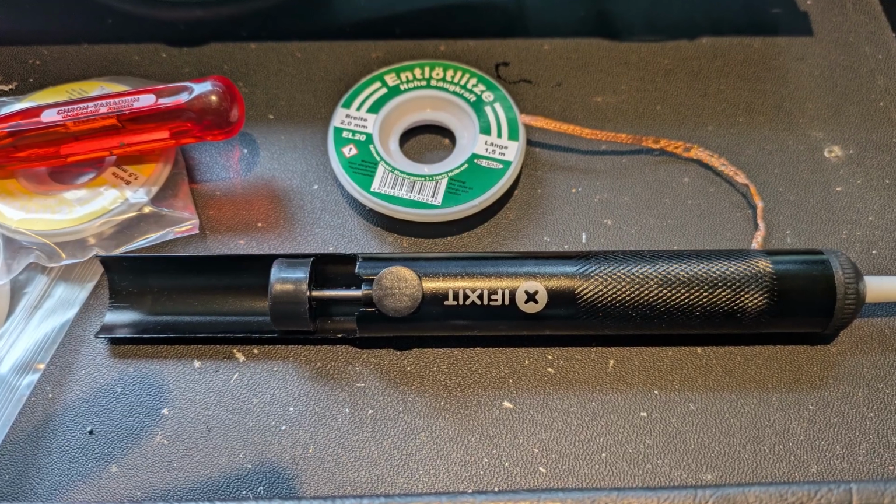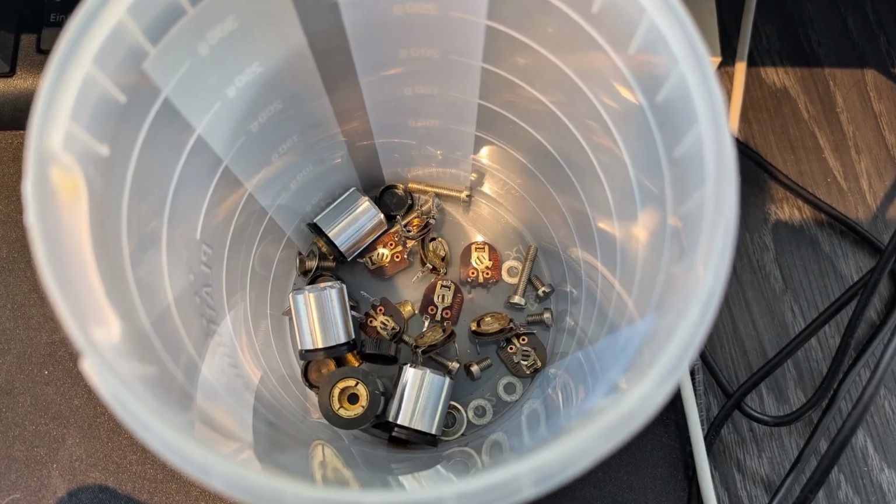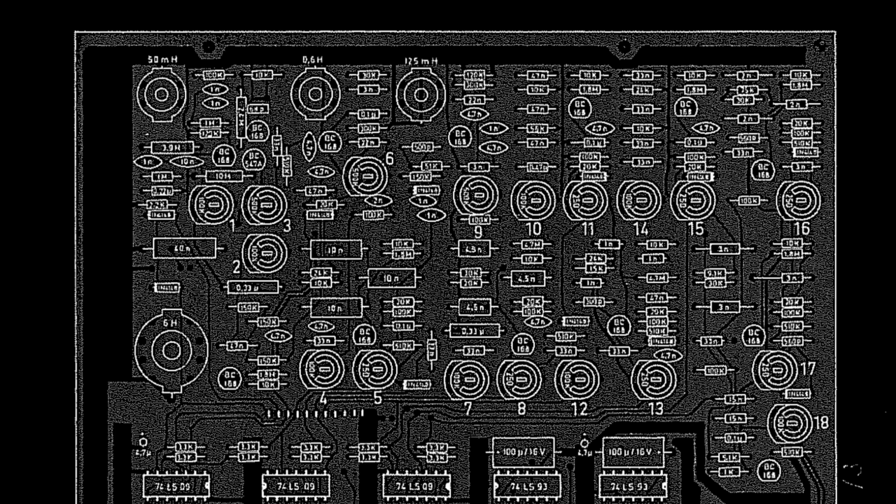Originally I had also replaced the noise intensity trim pot, but either because my cheap eBay pots are too low in quality or because of the extended wires, this led to all the noise-based sounds sounding absolute crap, so I put the trim pot back into place for the noise intensity.